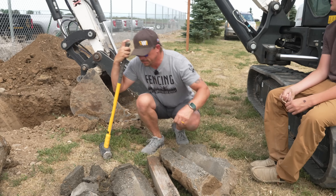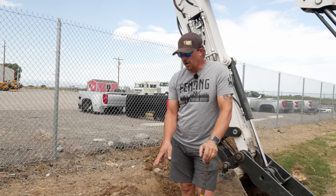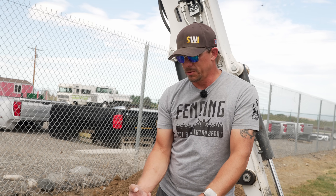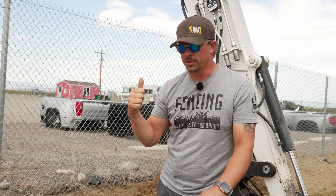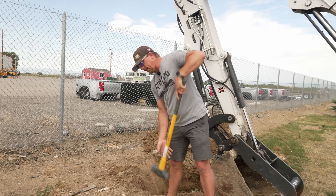Dry pack does work to get it hard, but it's not going to make great concrete. If you want really good, strong concrete you absolutely need to wet set it. For post backfill this dry pack method may work, but it won't give you the best result. Now this is the one we wet set and it has screws on it. I'm fairly confident the concrete is going to be more difficult to get off this post because it will grab onto the screws — but is that even necessary? With good wet concrete it's already difficult to get off a post. With steel posts we've pulled on them with a 9,000-pound skid steer — lifted the back off the ground — and the post still wouldn't come out of the concrete. So adding extra anchors to the post is really an unnecessary step and expense, but let's just find out.